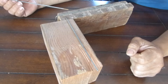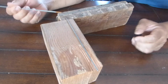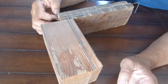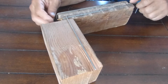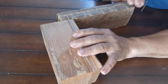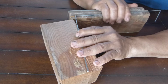Okay, looks like I've got to add this detail, if you will. The bottom bar, I want you to think of this as a beam. The bottom bars are number 4 and the top bars are 5/8 with the hooks. Now the bottom bar might also have a hook. If you can see this bar right here, I'll show it to you in the video. Imagine it's just sliding out, it just pulls away. There's some engagement there. Maybe it's able to pull it away with that. See how it pulls it down?